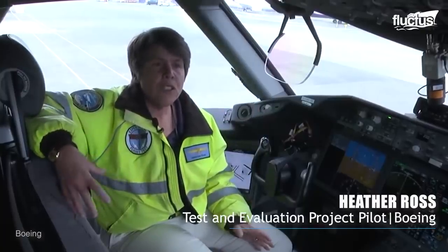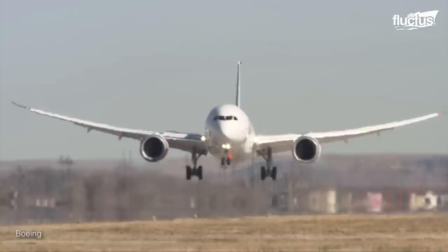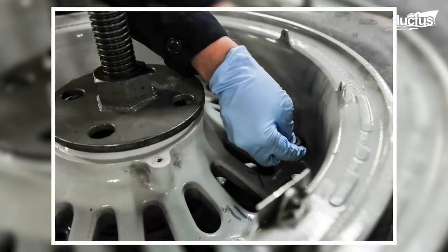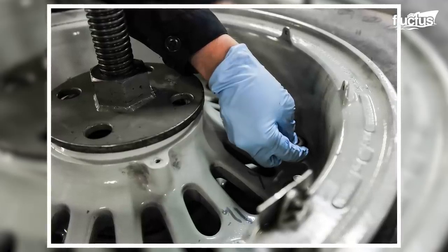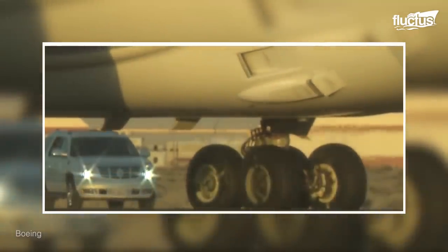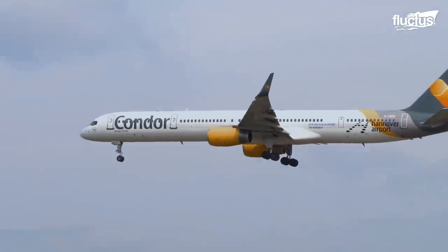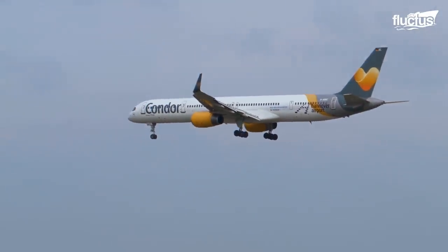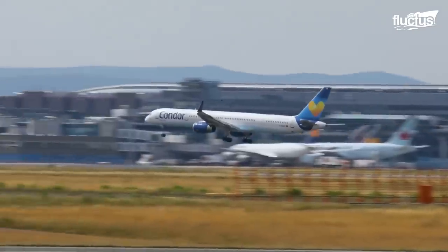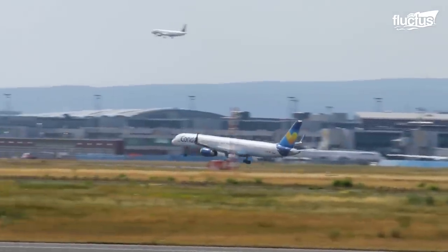We want to make sure that that occurs in a very controlled fashion. Also, overpressure relief valves, or OPRVs, help to release the nitrogen in the tires when they attain critical pressures during hard landings. On a large aircraft like the Boeing 767, the disc in the OPRVs can rupture and release pressures up to 450 psi.